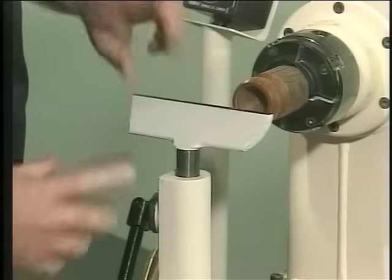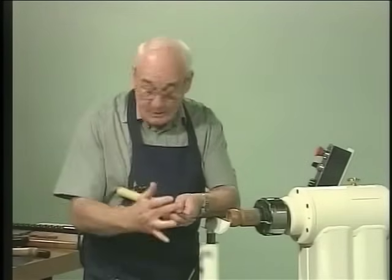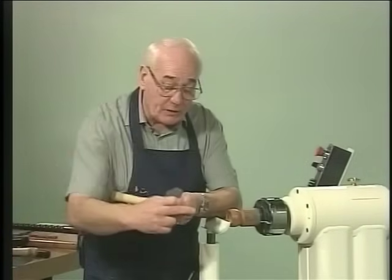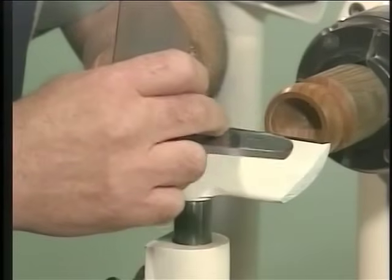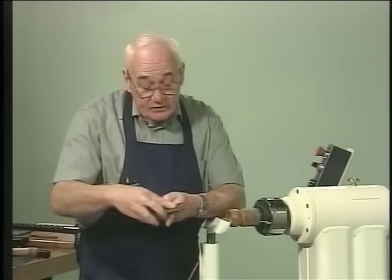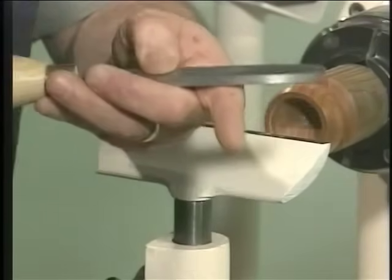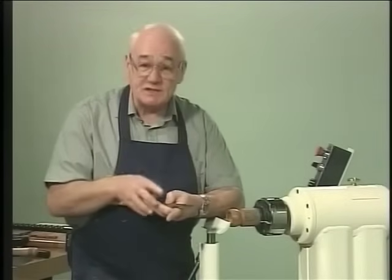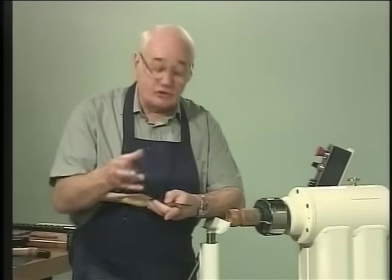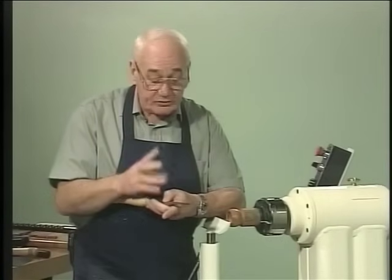And that's our box prepared to introduce a second tool, which is a scraping tool. A valuable tip here is when you freshly grind it, it will leave a burr cast upon the edge of the blade. Remove that by slip-stoning the top of the blade. This will avoid the tool snatching in close-grained wood such as this. Now that leaves the question, when to leave the burr on and when to remove it. Very simply, the answer is this.